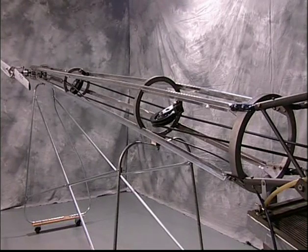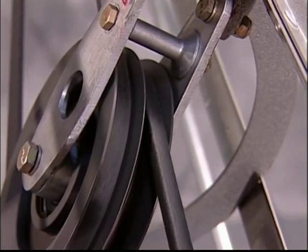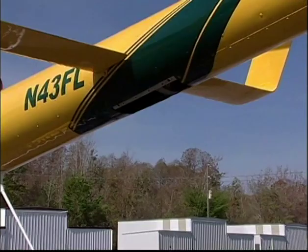The three new tail rotor drive belts will stretch rapidly during this time, and it is very important to prevent them from becoming too loose. A belt that is too loose could be damaged internally by rolling over the edges of the pulleys. It can also be damaged by the heat created from excessive slipping. Any belt that has rolled over may be damaged internally and must be replaced immediately to prevent belt failure.